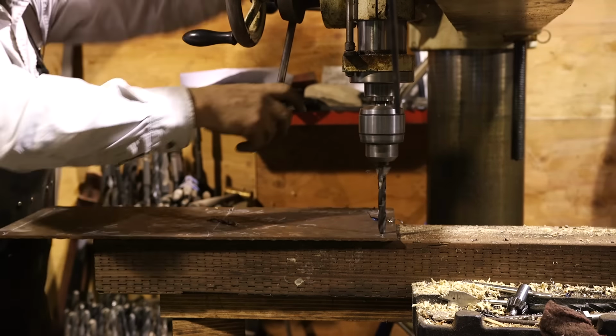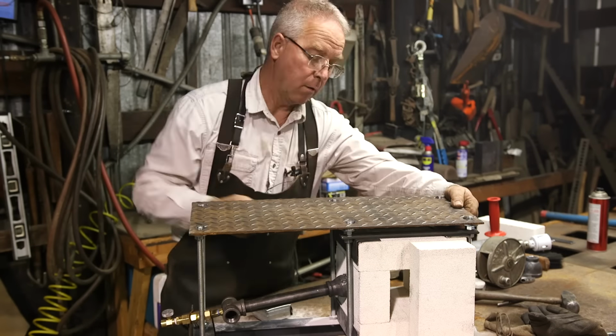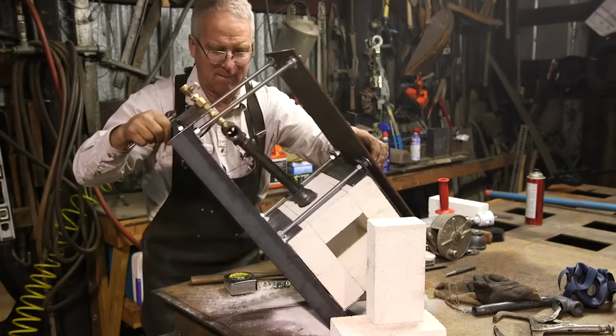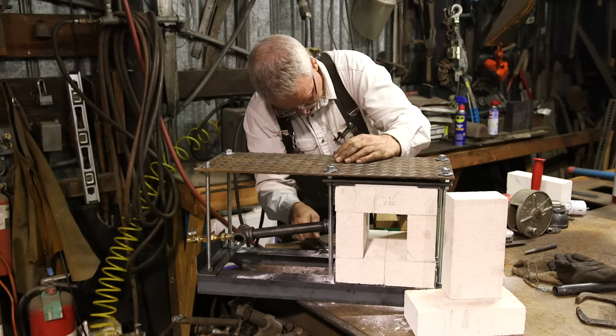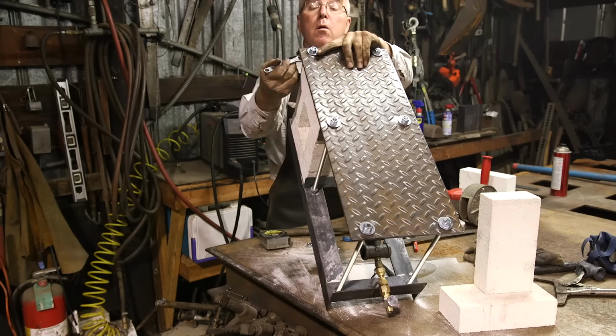You can put any naturally aspirated propane burner in here. You can make one, you can buy one, you can modify this easily and then just get a hole saw to match the outside diameter of the burner that you're running through the wall and just drill the hole. It drills just easy, as you saw. There are just a whole bunch of reasons that this is a good way to go.